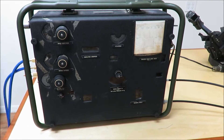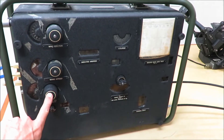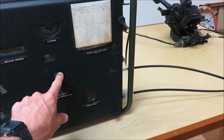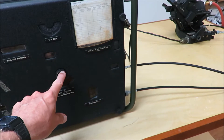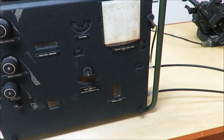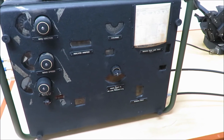These could actually be input before the bomber left the ground. The first of these was the terminal velocity of the bomb — this information was used instead of time of fall information, as with the Norden or the Sperry S-1. The second would be the barometric pressure at the target and the height of the target above sea level. The altimeter in the T-1 would calculate the height of the bomber above sea level, but it was necessary to know the height of the target above sea level so that the height above the target could be determined.